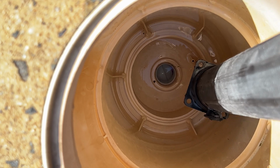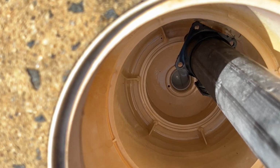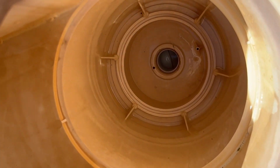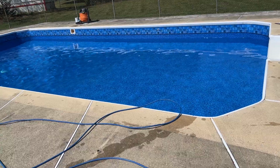And then you're going to wind up with a freeze up in the winter, and you're going to be breaking pipes in the ground. So take your time, make sure you blow it out. At least, I always do it at least 2-3 times, just to make sure that we have all of the water out of the lines itself.